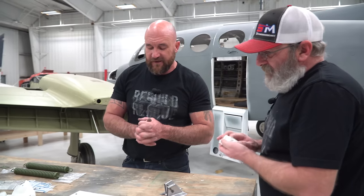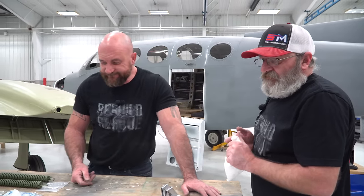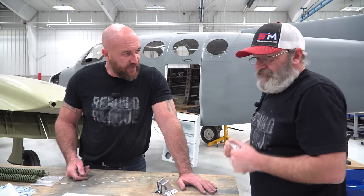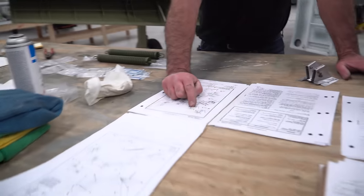So when I was in the fuselage, I looked at one of the trim cables a little bit closer, and I found a place where it was corroded through a good bit. So one of those trim cables, if not all the trim cables, depending on how much of a loop that is, is going to need replaced. On the floor, there's also one of these, and there's a pulley missing.